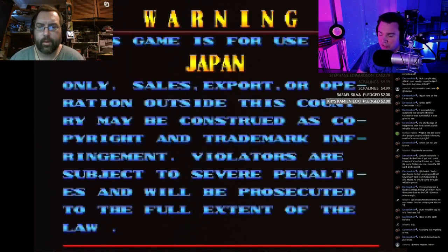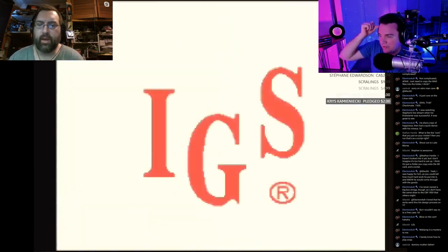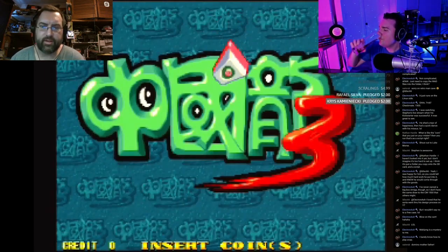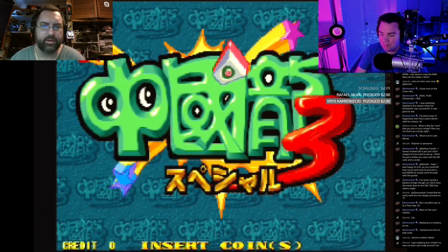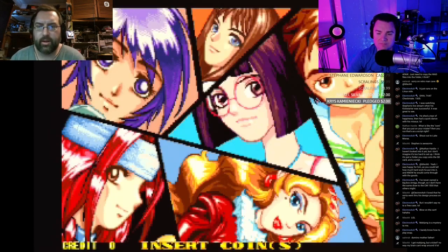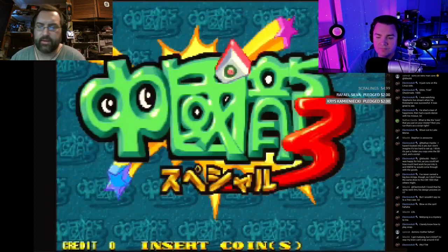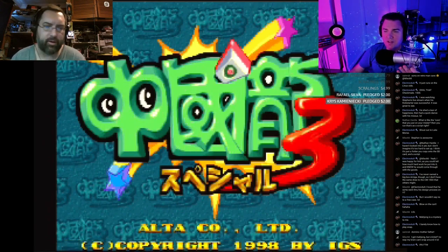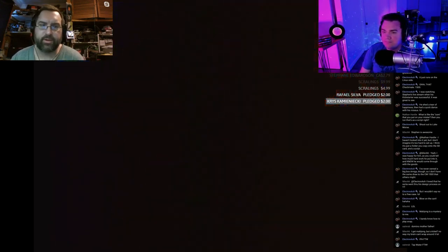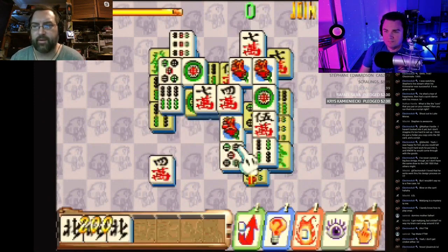I also have the dual-wipe version of the PGM slot, which is something Tim talks about. The dual-wipe is not as fussy — the Neo Geo also uses a dual-wipe with staggered pins which helps. For cleaning, cotton buds with IPA alcohol is the best. If you don't have that, methylated spirits works fine and won't cause any damage.